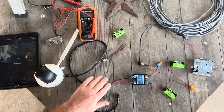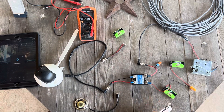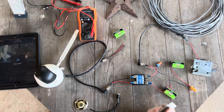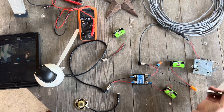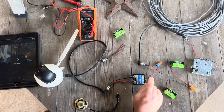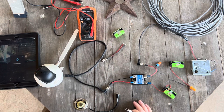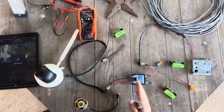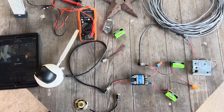You can see I've got my camera connected, the relay's connected, the latch is connected. Anything metal you have — a pair of needle nose pliers, a screwdriver, a little short piece of wire, a pocket knife — anytime you want to test from the output side to your latch, you can just short these terminals. You're never going to hurt anything on the camera side because using the solid state relay you're electronically separated. So it's just a really easy way to test from the relay all the way to the latch.